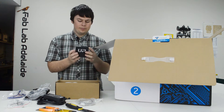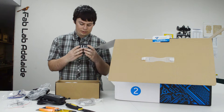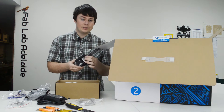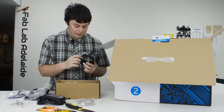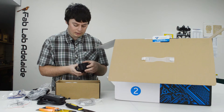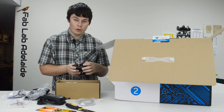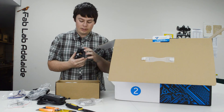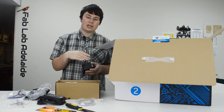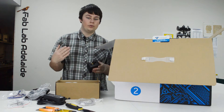This extruder is a bit of a tank — it looks about twice the size of a normal UP extruder. It has a cooling fan on top with a nice guard, and a pin connector to the machine. There's a plate for snapping it into place, the nozzle, the new heater block, and on this side there's a slidable vent cover. The old UPs had a thin handle vent that would snap off, so this is an improvement, though I'll note a downside later.